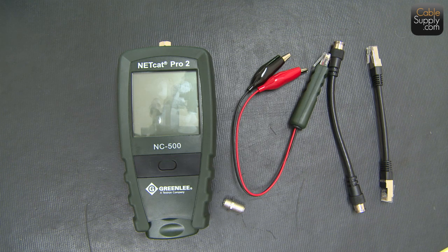People say, 'Well, you finished the job and now I plugged in and it didn't work.' And of course it's not fair to the IT staff — if you're a cabler they're trying to troubleshoot a problem and they think your cabling is fine, but they find out later that it's a cross pair at your jack. Those IT guys that don't do cabling every day can spend a couple hours researching a problem, full of frustration — and of course they have bosses too. So you want to test every single cable pull.